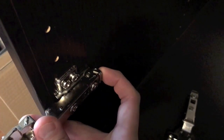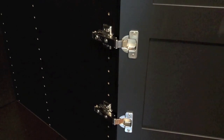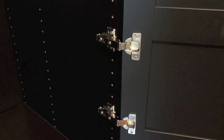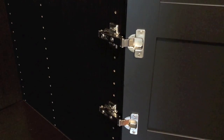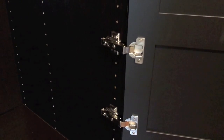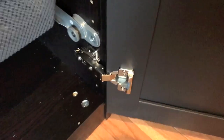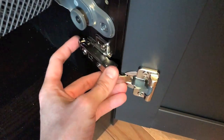Now on to the left side of the storage unit with the door connected to it. Anytime you are removing a storage unit door or a cabinet, it is always smart to start at either the top or the bottom, and the last hinges you disconnect are the middle. That is because of the support pressure — if you remove the top and bottom and that middle hinge is last, imagine the pressure on it; it's going to harm or bend it. Whether you start with the top or bottom is personal preference.